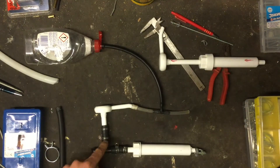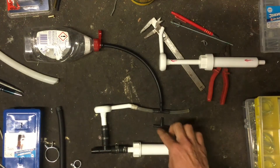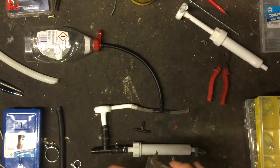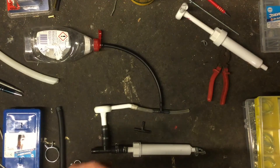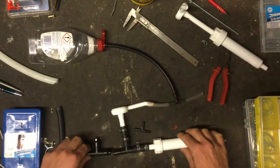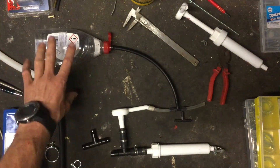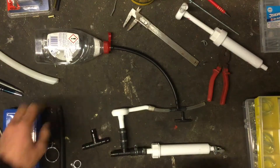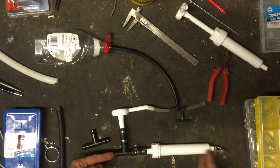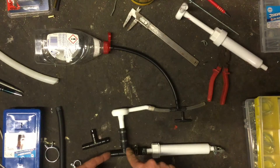As well as that we've got a couple of T-pieces — one T just there at the top, which I believe is 6mm exterior diameter, and these are 13mm diameter on those. Basically we've got an air chamber that receives pressure and compresses some air. This is always going to have air in it. Water flies along, hits this one-way valve, comes out, and jams the valve shut.